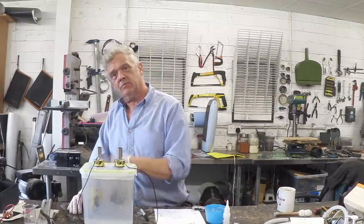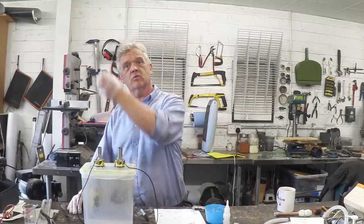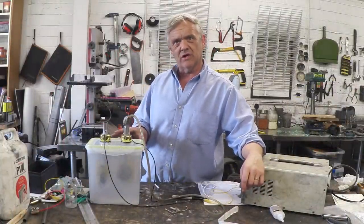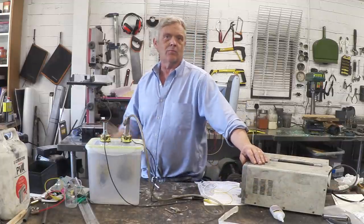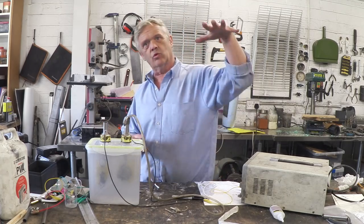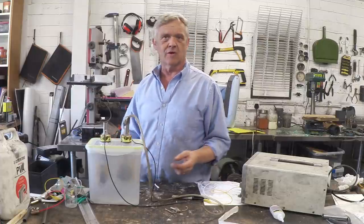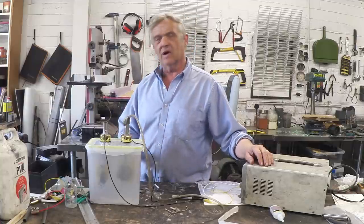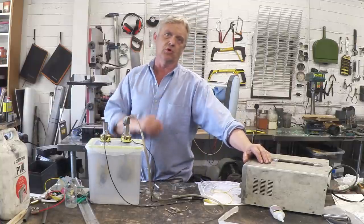The hydrogen has a positive charge so it's attracted to the negative electrode — the negative is the one spewing out hydrogen. The nitrogen is spewed out by the positive, so we want to capture what comes out of the negative and vent the positive. Run this at 1.4 volts, which guarantees that only the urea is being electrolyzed and not the water, because with the internal resistance of the cell the effective voltage is lower than 1.23V. You'll see it drawing about 50 milliamps, and that draw will go down; when the urea is exhausted it won't draw anything — maybe a milliamp or two. So you can keep a check on hydrogen generation, and when it's exhausted you add more urea.